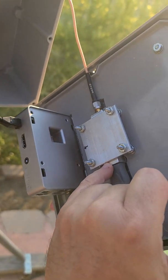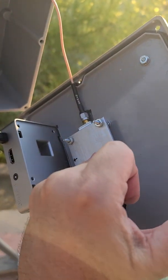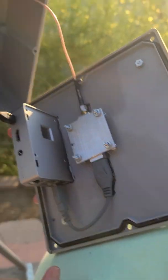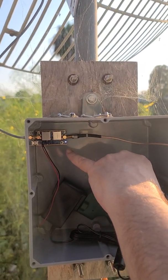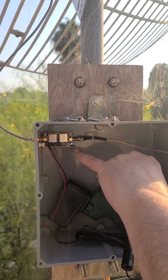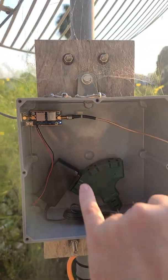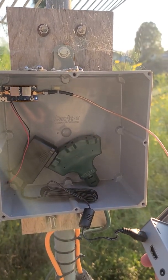This little guy here is the RTL-SDR with a built-in SAW filter for GOES. This plate is just to hold it down against the heat sink plate. The Sawbird — I believe it's from NooElec — it really does help. That's the LNA and the SAW filter in those two little silver boxes. This is just the RTL-SDR and it has the bias-T in it.